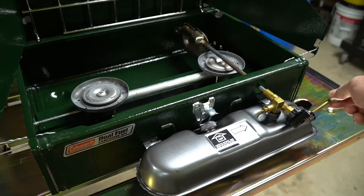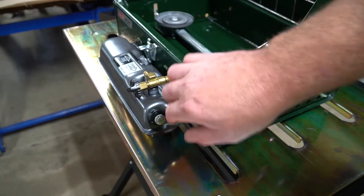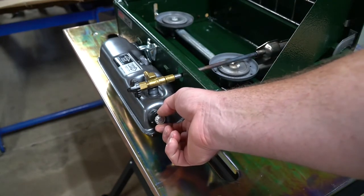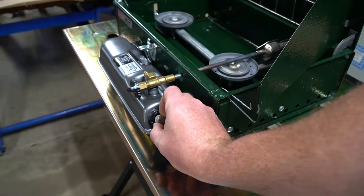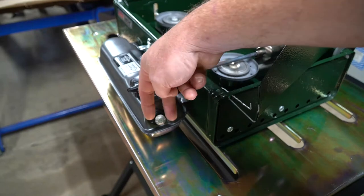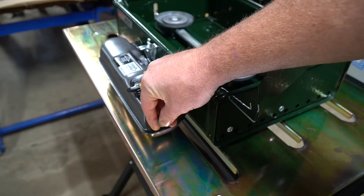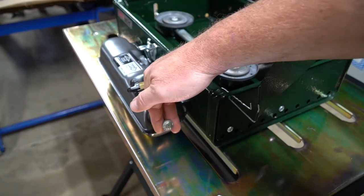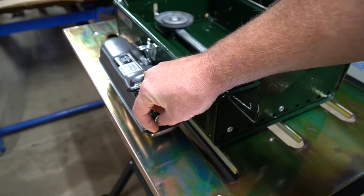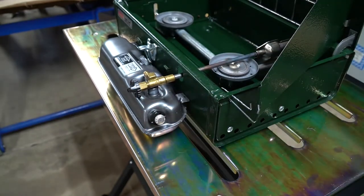And then there is a pump on the end. This pump has an incorporated valve, and to use it you need to open that valve up. To open the valve, rotate the knob counter-clockwise one full turn and now you're ready to pump the gas tank up. To do that, pull back on the plunger, put your thumb over the hole, and shove the plunger down. Take your thumb off the hole, pull back, and shove it down again. Do this about 30 times, then rotate the valve clockwise to shut it off.